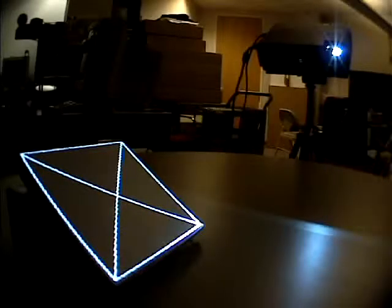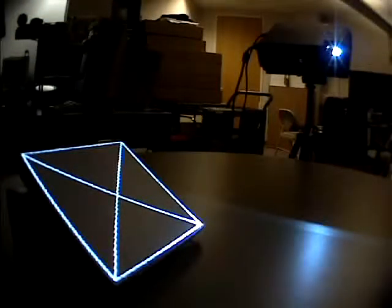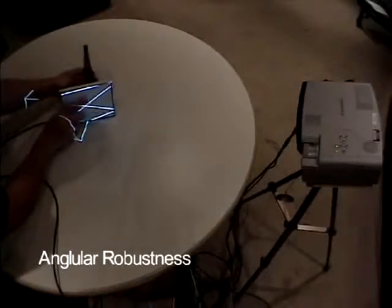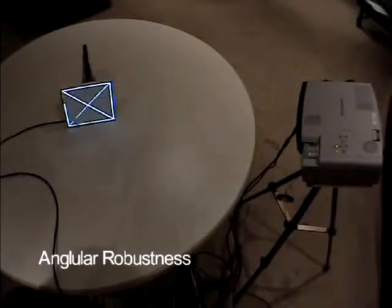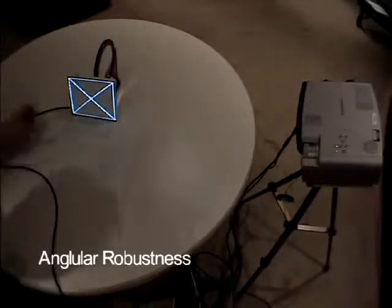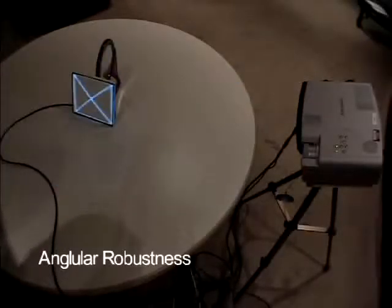Here's what the calibration process looks like from the perspective of the target. You can see the irregular flashing from the projector. This pattern of flashes indicates the location of the camera in the projector screen space. To illustrate the robustness of this technique, we will gradually decrease the projection angle of the calibration. We have found that the calibration continues to work reliably even when the projection angle is less than 2 degrees. In this last calibration, the screen is actually facing slightly away from the projector. The expansion of the projection frustum is sufficient for this technique to work.